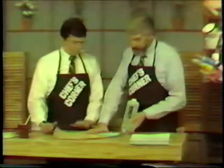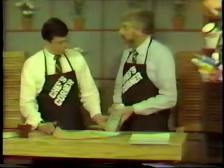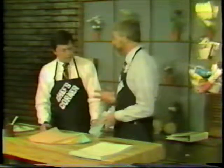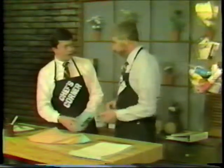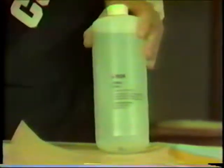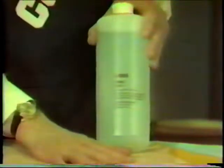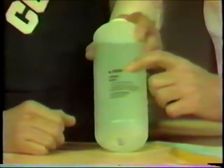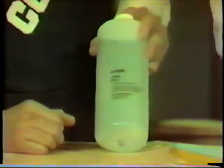The only thing that you have to remember is that this particular series uses the green etch. People may have been using the 6- series, and with that they were using blue etch. Ah, okay. So that's a significant change that everybody should know about. Right. With the new complete line of 2- series, you use the green etch only, no more blue. No more blue. Okay, for direct image only. For direct image only. This would be used full strength, 4-1034 in quarts, 4-1035 in gallons. Okay, all right, good.